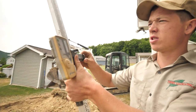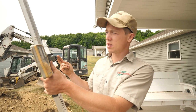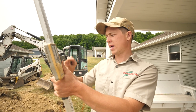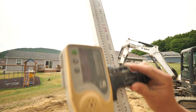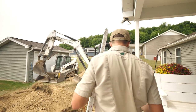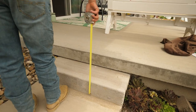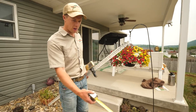Pavers are two inches thick and I need an inch of setting bed, so that's three inches. Then I want six inches of base, so that's nine inches. From the top of pavers to excavation is nine inches down — that's how far I have to dig down in the center area here for the patio. This should mesh in because this is six inches and this is six inches, and we came down 12 inches there. So this is going to be patio height as well. If it had been a little higher or lower, I would have just sloped it up or down.